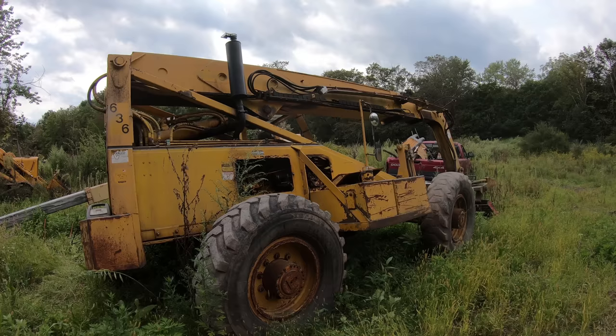There's this seal right here. You can see that seal has a break in it. Hopefully that's what the problem is. And the thing about this seal is, if this is leaking, it makes me wonder, am I losing compression because of that? Because that would explain the lack of power. If one cylinder's not getting near the compression that the other ones are, then that could explain the smoke and loss of power.